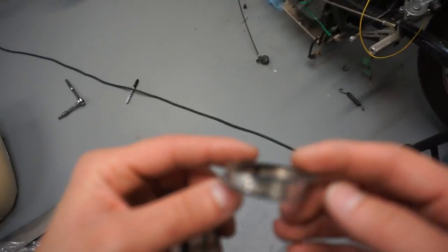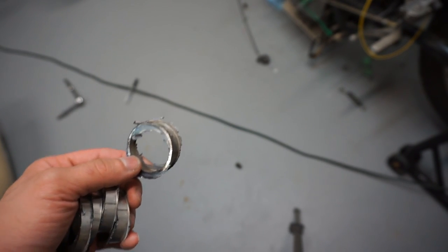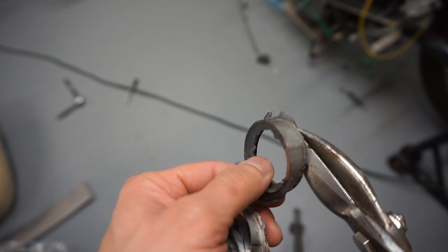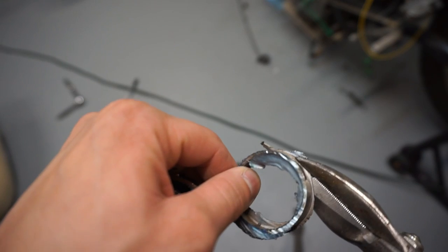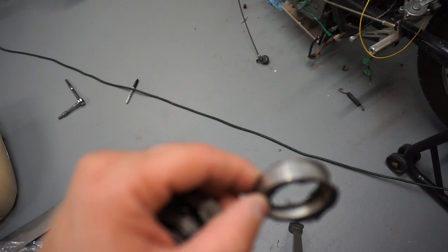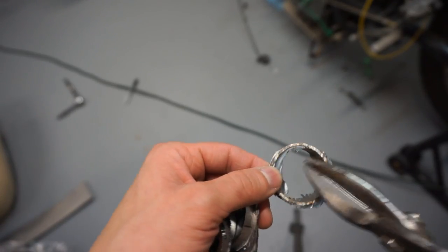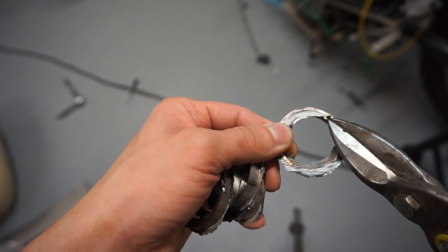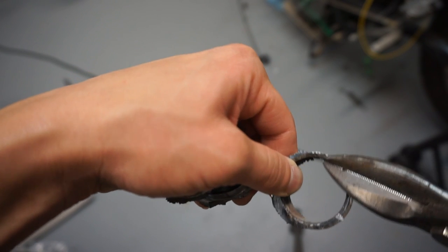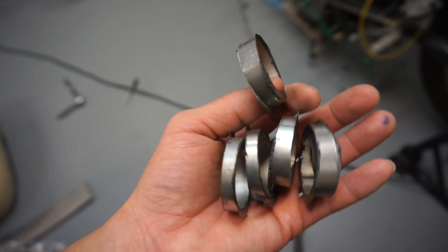Because of the type of blade I'm using, it's going to be really ugly and tedious to clean up. The best approach is a two or three step process: use some tin snips and snip around the pieces to get the shards off relatively easily, then use my bench grinder to sand it smooth and finish it off, and then use a rat tail file on the inside of the tubes. I can chop this part off too, but it'll still be jagged, so the file finishes the inside. It's going to take a little bit of time because I have probably 20 or 25 of these things, but I think it'll be worth it.